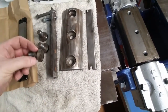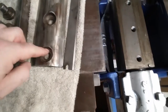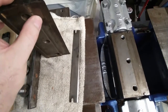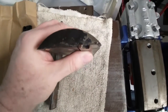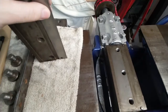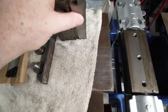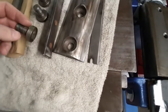So as long as I tighten it back up like it was with this, I don't think it'll have an issue. The cap of the bolt hits this step, and then this piece hits on the blade itself. So it's a lever between this outside edge and the blade when it's in that slot. So when the bolt comes down through, that puts pressure on the fact that the blade is sticking out, and so it's pulling down between those things. So I guess you theoretically could over crank it, but you'd have to put an awful lot of pressure on, and based on what I can see here, that didn't happen.